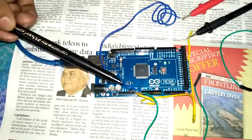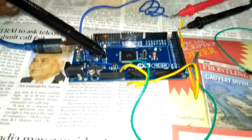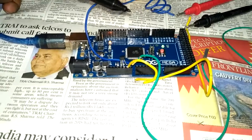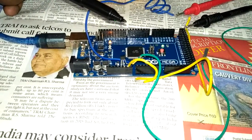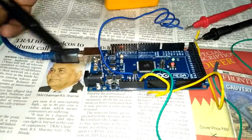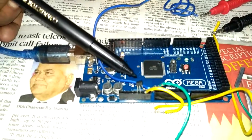This is a Hall Effect sensor which is inserted into an Arduino board. I have inserted this component into the Arduino board just to avoid extra wires, but for a proper connection we should do it on a general purpose board and do corresponding soldering. The first pin is connected to the 5V output of the board, the second pin is connected to ground, and the third is tapped out and connected to a multimeter.